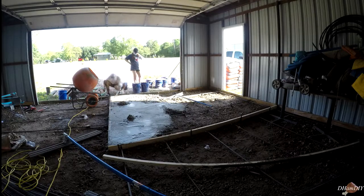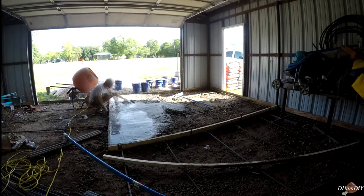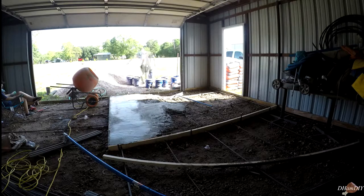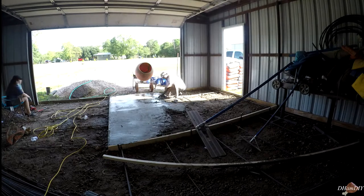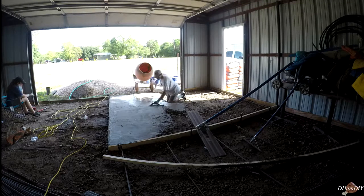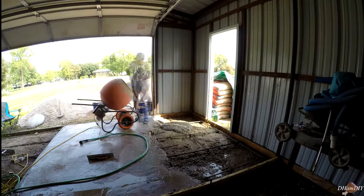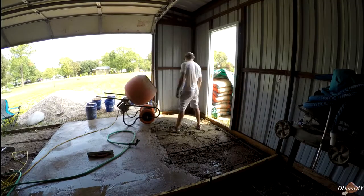When we first started pouring this section I actually poured it way too dry — the mix was very hard, I could almost walk on it. But as I was pouring these six sections for the shed — each 10 by 12, so 120 square feet per section — I got a lot better each time. You can see me using the hand float a lot initially, but I ended up switching over to the big four-foot bull float.